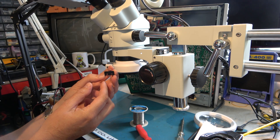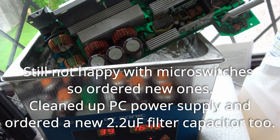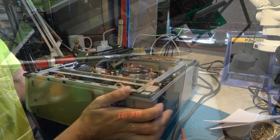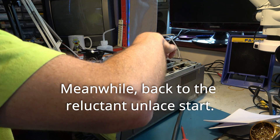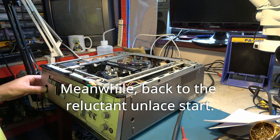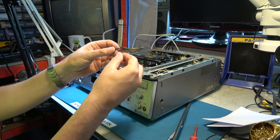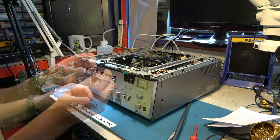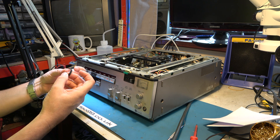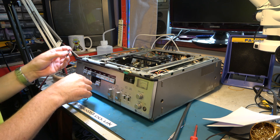I put the switch through the ultrasonic tank, along with that circuit board from the PC. I'm thinking the loading slipping might actually be the belt itself, so let's change that loading belt — quite easy to change. The belt does feel like it's out of shape and not in good condition. I have a belt here — it's actually intended for a Sanyo Betamax — but I think that should do it. If it's too long I'll try a different one, but that feels better.